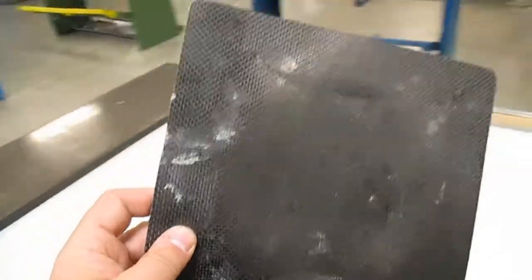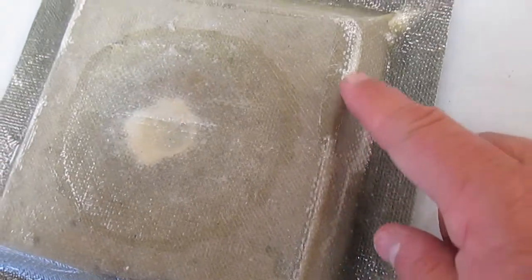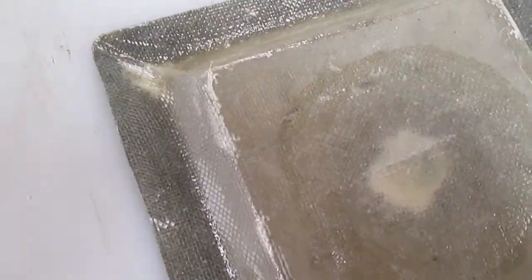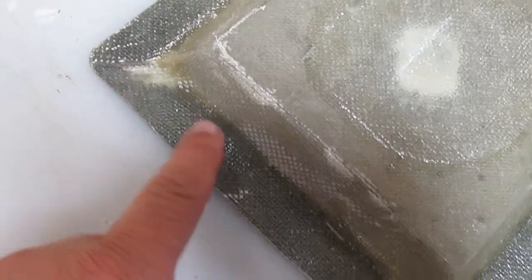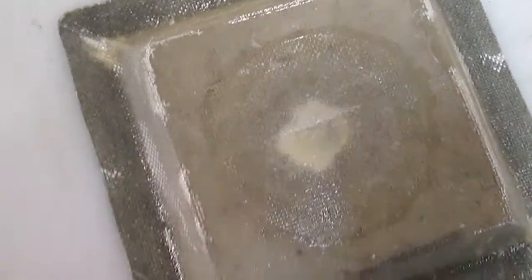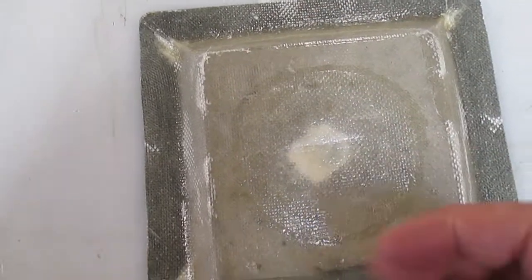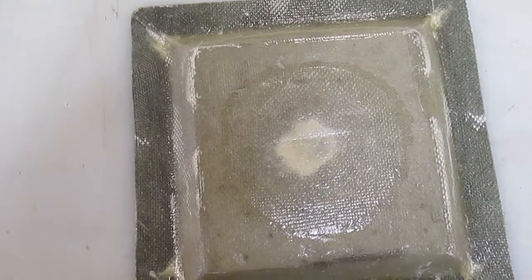The big thing with carbon fiber is, because of its black opaqueness, it's super hard to tell that there's been delamination. But when you start looking at the fiberglass on the backside, you can immediately see spots where it's delaminated, because the material has changed color. The back layers obviously didn't get as much abuse as the front layers, because there would be tons of separation in the center on the other side. You can see we've done a repair right here — it's got all the different layers, all the different patches — a step repair to carry out a repair there.